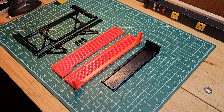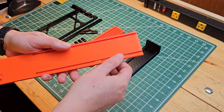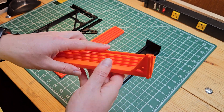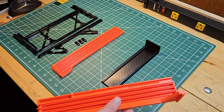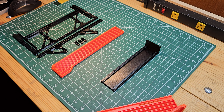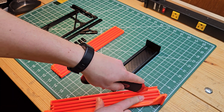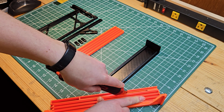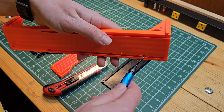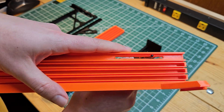So this is the large one — I'll show you how it goes together. With all the Gen 2 adjustable steel sheet holder XL parts printed, grab this piece. This is the right side of the holder, and there is an adjustable slot that we need to clean out. Use an X-Acto knife or utility knife to cut that extra material out from the print. After cutting, a deburring tool works awesome as well.